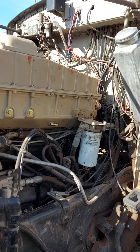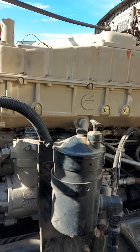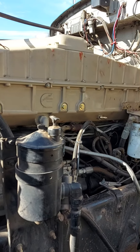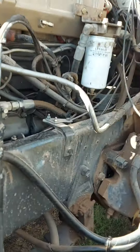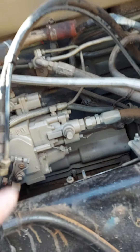Welcome to my channel, God bless everyone. We've run into some problems because the bolts on this new aftercooler need to be longer than the old one since it's thicker. That means I'm going to have to relocate a quarter-inch line, move the governor down, put the line in the hole on the other side, and secure it down with U-bolts or a radiator clamp.